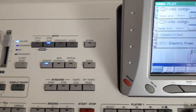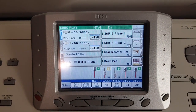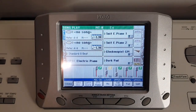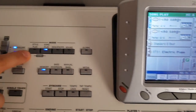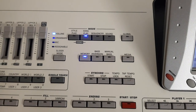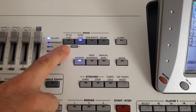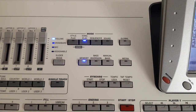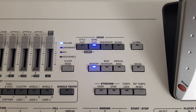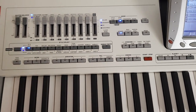I feel like the device is completely lost and it seems like I have a hardware problem. I don't know exactly whether it's a problem in the main board or the audio amplifier board. I used the test mode of the device by holding Play Style and Media buttons while turning on the device to enter test mode. When I ran the test, the result was that these three LEDs are permanently turned off and I could not turn them on. But all other test steps — testing the PCM RAM, the hard disk, all the buttons and keys — everything was fine.